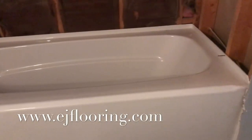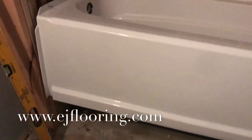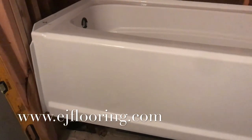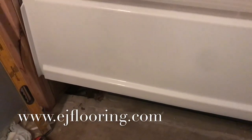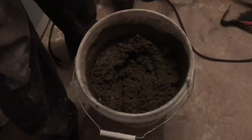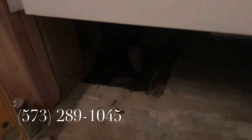We're going to set this bathtub. You can see what we did — we've dry laid it in place. Once we've got our drain ready to go and our level lines marked, we know what it needs to be set level to. To set it level, we're going to use this sand mix to pack under the tub to make sure it's fully supported. You can see where our drain riser is.